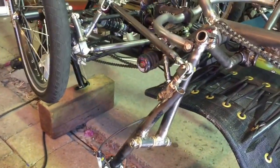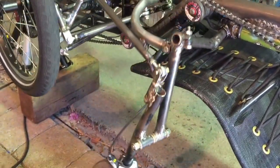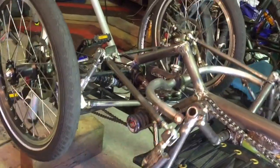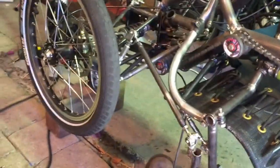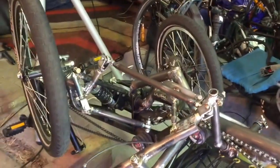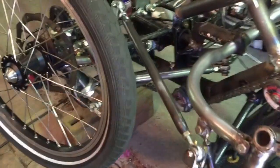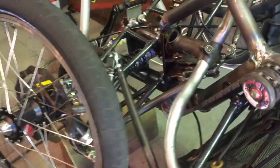So that was steering. Tilting is basically pushing and pulling the levers side to side, and up and down as well. So the same levers are actuating both the tilting and the steering, and you can steer at the same time as you tilt. When you're tilting that much you'd normally be steering inwards, and vice versa — when you tilt in the opposite direction you'd typically be turning in that direction. The geometry of the various linkages is a bit complex to account for all of that motion.